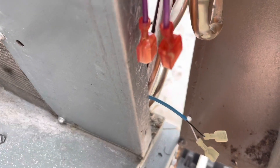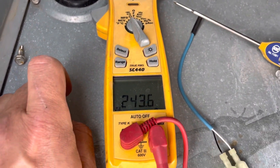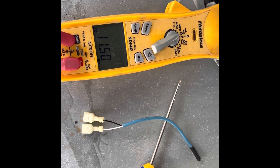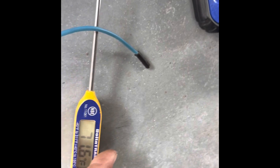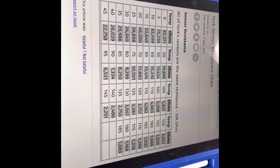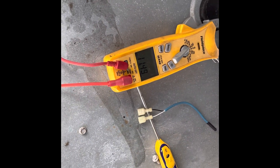I have another one in here — that's sensor number two. I'm going to pull that one and test it and see where we're at. Sensor number two is at 11.5k, so that's 11,500 ohms, and that's right about where we're supposed to be at 71 degrees. I left that one in place because I didn't want to disturb it since I know nothing's wrong with it. At 70 degrees we're supposed to have 11.8k, we're at 71 and reading 11.49k, so I know that sensor is good.